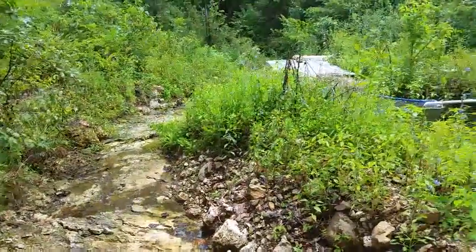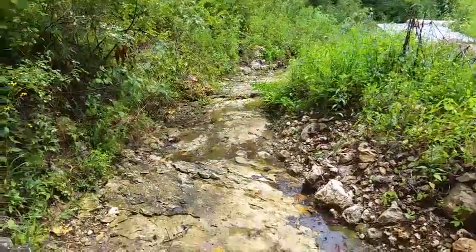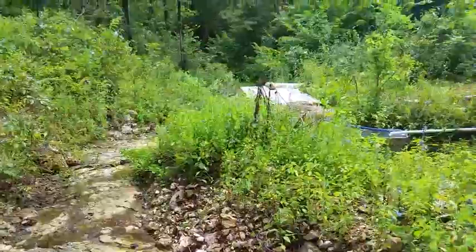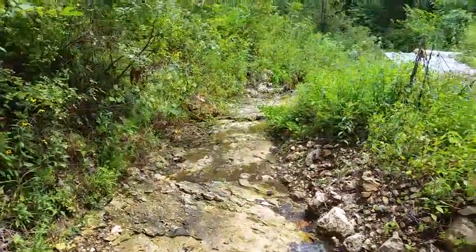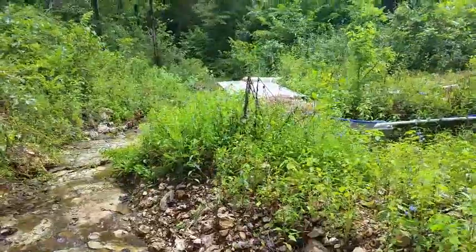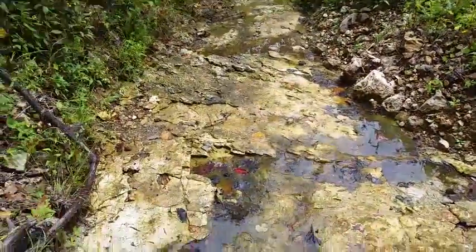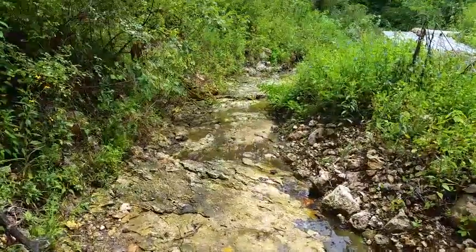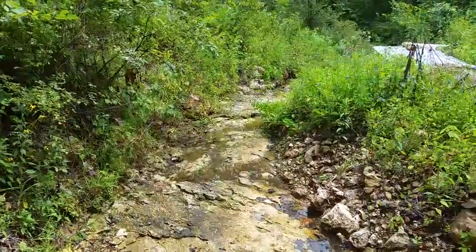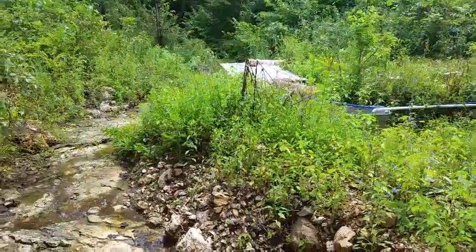And over there you see the cistern that I've built. You can just see the top of it. Now, it's not a real good idea to put your cistern right beside the creek. Why? Because you can get contamination, you can get overflow into your cistern and get mud and all of that. However, with this system here, this is broad and wide enough that it can survive a 100-year level flood and still not get flooded.